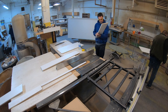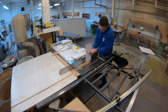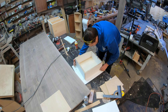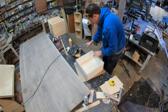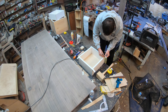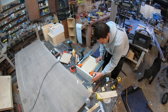With the side table boxes in place, I still need to create the drawers, so I'm making a box. Whenever I make a drawer I always ensure that I have a dado installed into the pieces so that I can fit everything together with relative ease and ensure it's at a perfect 90 degrees. For an additional level of complexity, I got some undermount slides so the drawer is going to look like it's naturally floating outside of the side table.